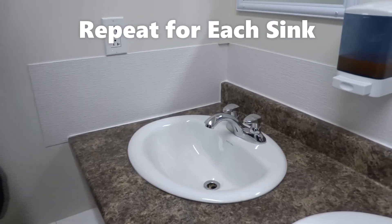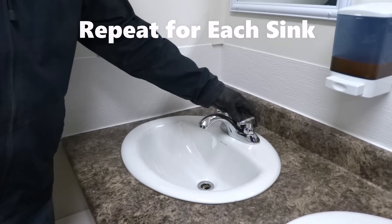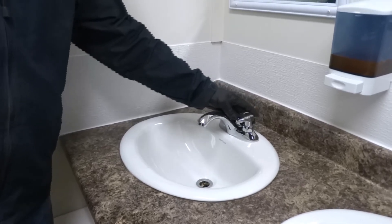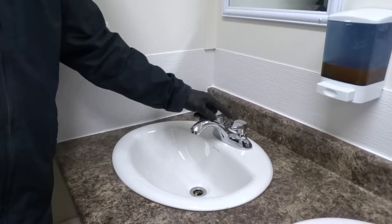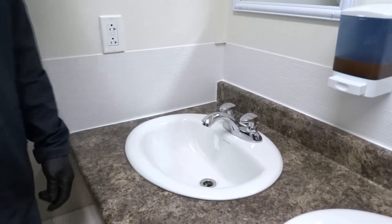After adjusting your toilet, come over to your taps and test them. Lightly push down on one of the handles to make sure you've got water pressure. If a tap doesn't have pressure, you might have to reach underneath the sink — there are two valves on each side of the tap that you may need to turn on. But they should already be open. Your tap is ready to go.